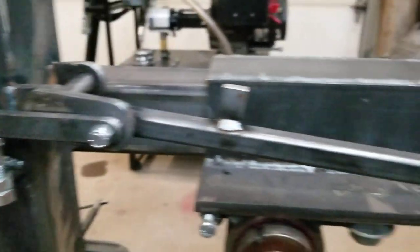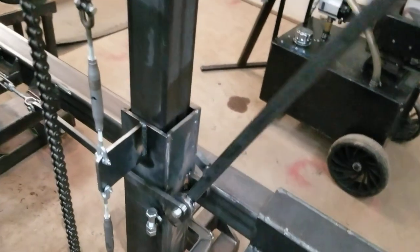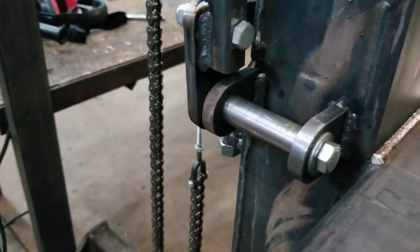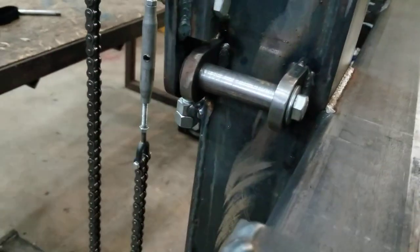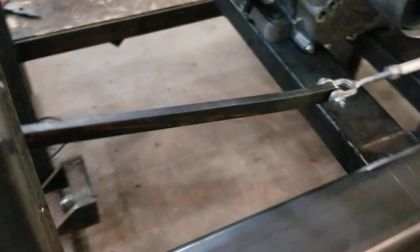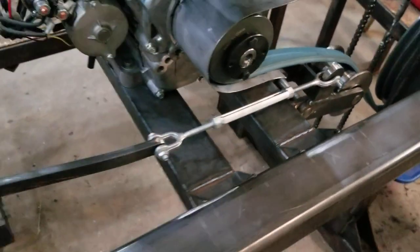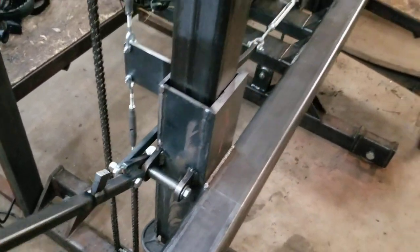The handle is a little bit too long right now — I made it two feet long and this is plenty. Now that I've actually finished it, I realized the material I used is way overkill. This is three-quarter inch here, and this is three-eighths of an inch with a three-quarter inch hole, and the rod is three-eighths by three-quarters. This stuff is definitely never gonna bend, but I'd rather do it once and do it right and never have to touch it again.